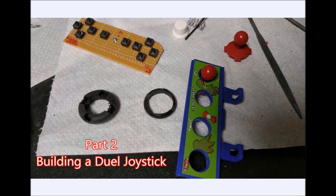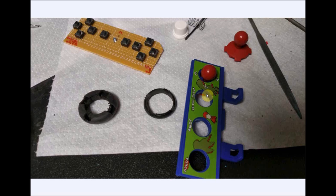This was definitely the hardest part — trying to make a dual joystick out of this unit. I took a prototyping board and used a bunch of momentary switches, and they fit actually pretty well. I did have to modify the buttons — I had to cut some of the bottom off because they were a little bit higher. This gives us one joystick up, down, left, and right; a second joystick up, down, left, and right; and two action buttons. I had to cut most of the pylons off, leaving only one screw hole, but when you put this into the housing it'll get support on the sides and back.